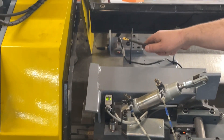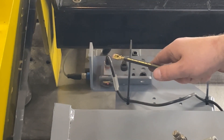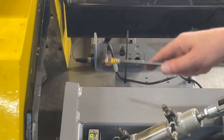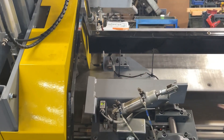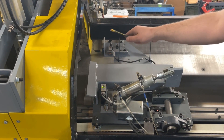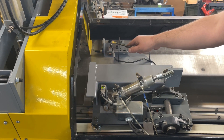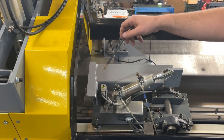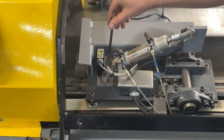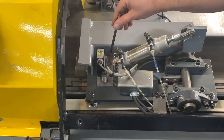Then there's a length sensor over here. This is actually a laser distance sensor. It's measuring the distance from the sensor to whatever's behind it. We're using changes in that distance to detect the presence of a board against the fence and on the table. This can be in two different positions — we have it up here on this outrigger, which allows us to better detect and measure longer bowed pieces of lumber, but there's also another mount position where it can detect rip stock that lays flat against the fence, giving more sensitivity for running thinner pieces of lumber.